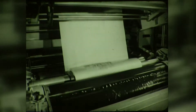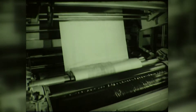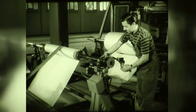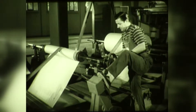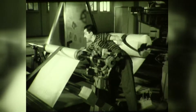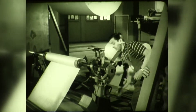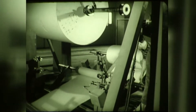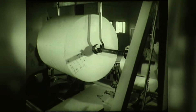One of the inking units with the cover taken off. The inking rollers continue running even when the machine is stopped. Change of paper reels is carried out whilst the machine is running. The parent reel is swung out when it reaches a diameter of about 12 inches. The fresh reel is then placed into the now empty bearings.